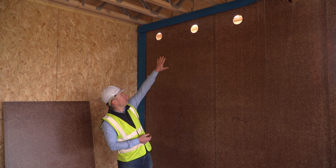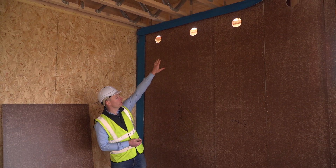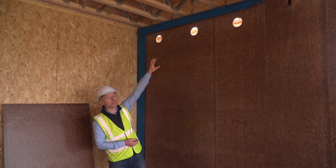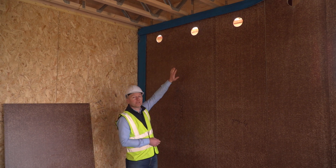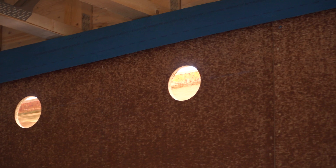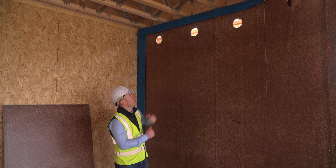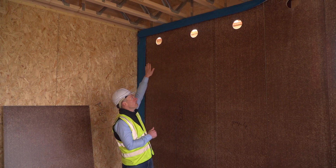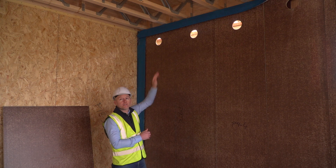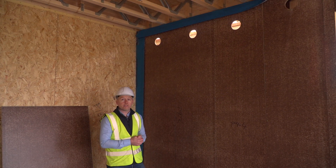You'll notice in the Finza board at the top level and in some other areas there are pre-drilled holes. These cores are drilled in the factory by the timber frame manufacturer, Timber Tech Homes. The principle is to allow the installer to later apply a hose into these holes and fill the timber frame panel with cellulose insulation. Then it's simply a matter of applying a Pro Clima Vana patch — an airtight patch — over the holes to ensure an airtight seal at that junction.